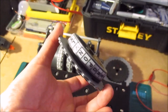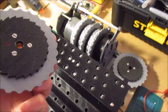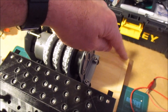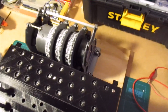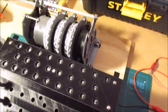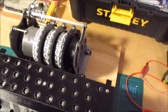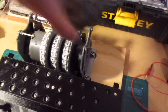I finally got around to gluing the letters on the final two rotors. And because this is a version of the Polish double — in the real Enigma machine, the battery pack actually goes in here. The real Enigmas used a four volt battery. What I'm going to do is what they did on the Polish machine, which is power the machine from an external power source. And they actually had storage in here for the two spare rotors. So I've designed, and I'll print up tonight, the little bracket that goes in here that holds those two spare rotors.